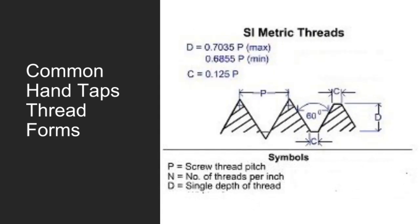Metric screw threads — M series threads — are defined in international standard ISO. Each thread is characterized by its major diameter D and its pitch P. ISO metric threads consist of a symmetric V-shaped thread; in the plane of the thread axis, the flanks of the V have an angle of 60 degrees to each other. The thread depth is 0.614 times the pitch. Tip: to calculate the tap drill size for metric threads, the diameter of thread minus the thread pitch will give you the required tap drill size. For example, for an M6×1 thread: 6 minus 1 equals 5 mm — use a 5 mm drill.